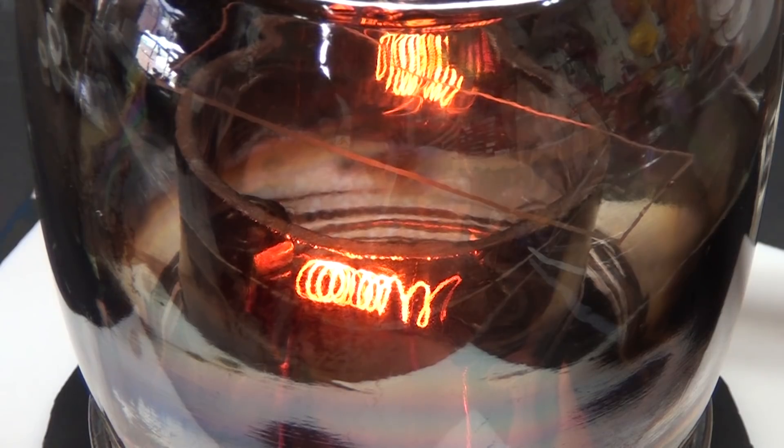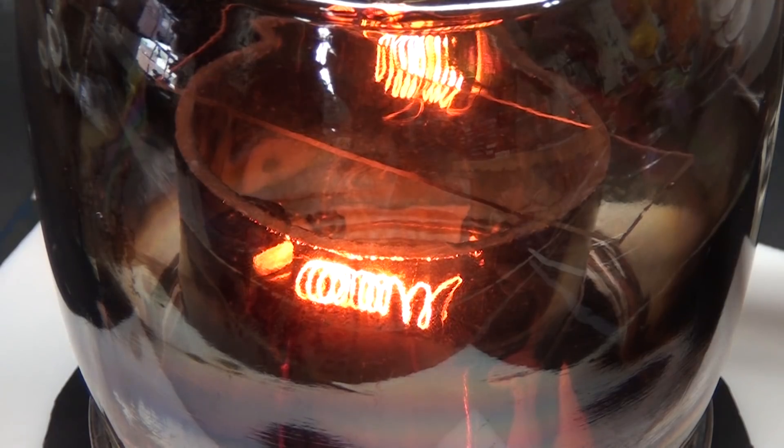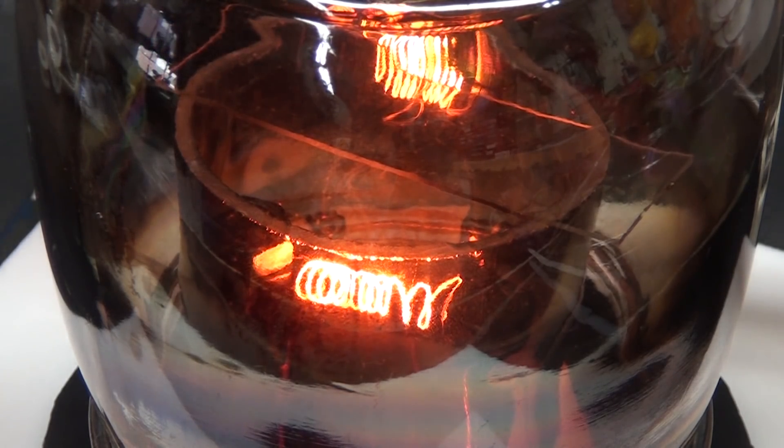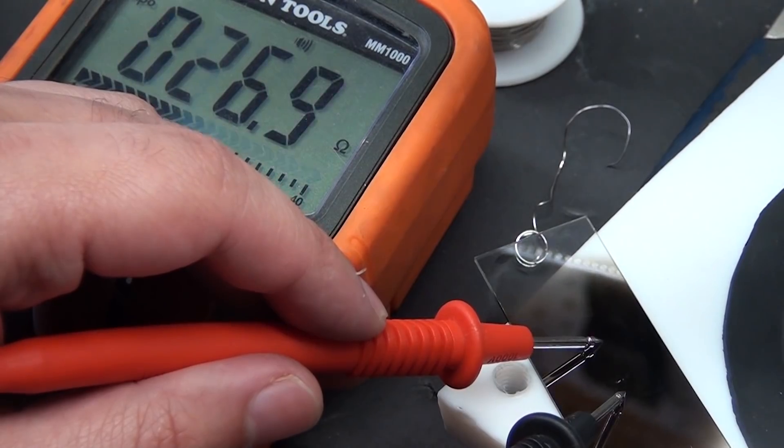When I was first testing this, as usual I was using a microscope slide as my test sample and sure enough, as soon as the wire got hot enough, immediately titanium started to fly and it seemed much faster than the magnetron. After one or two test runs just to make sure the system wouldn't melt or explode, I let it really go and got a beautiful titanium mirror. Best of all, it was conductive so this really is titanium metal.